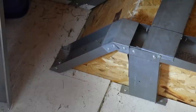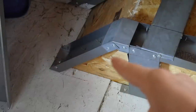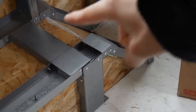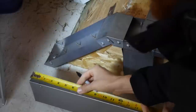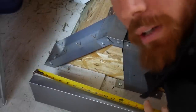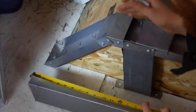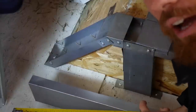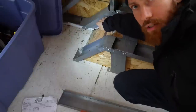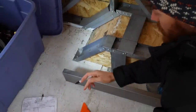When figuring out what points we want for our bends and cuts, we have to think about things like where I'm anchoring the piece to the floor - there's an extra inch and a half there - then that diagonal piece, the super long piece all the way across, and then the same situation on the other side. To mirror this part I have an inch and a half, and I'll mark it once and use my square to extend the line all the way around for a nice square cut. To determine the diagonal length since we're at a 45-degree angle, you can take the height of your wheel well and do Pythagorean theorem to figure out exactly what the hypotenuse is. In this case I'm just going to copy what I did earlier - you can measure based off your existing opening on the wall. For me it's 12 and a quarter inches, so I'll go ahead and add that mark.